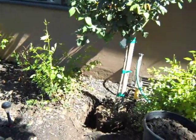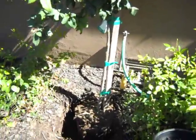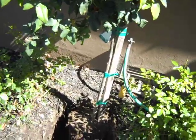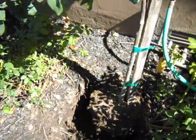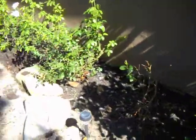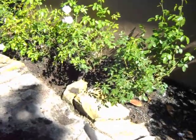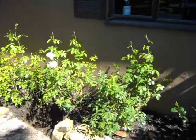It's important when you're working in these older homes to be very careful not to disturb the utilities. Don't take a pick and forcefully excavate your holes, or allow the gardener to. You'll wind up with broken sprinkler lines, broken water lines, a punctured gas line — any number of things. It'll take a pleasant garden addition and make it an absolute maintenance replacement nightmare.